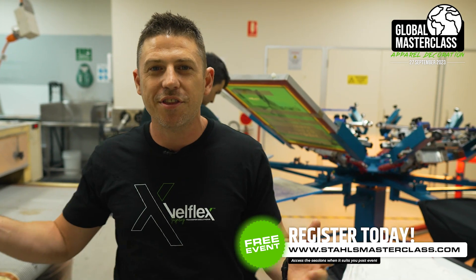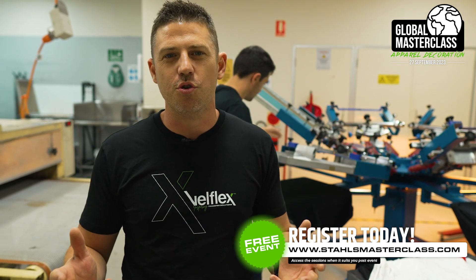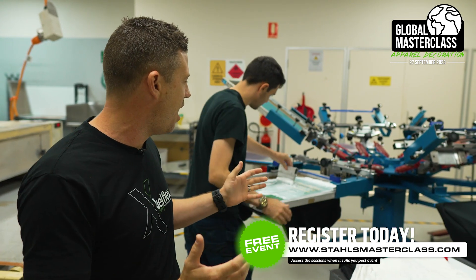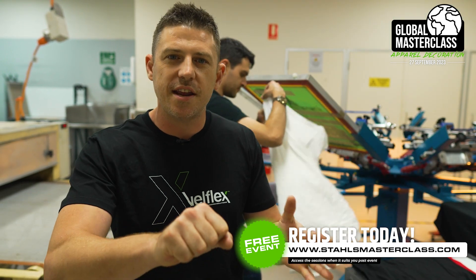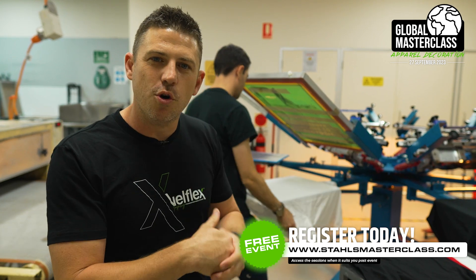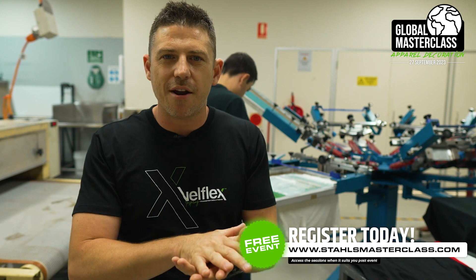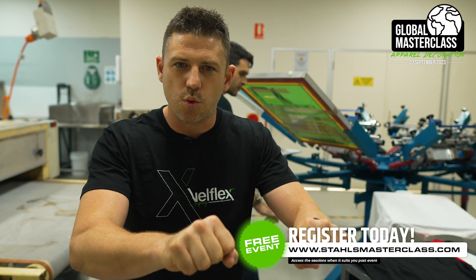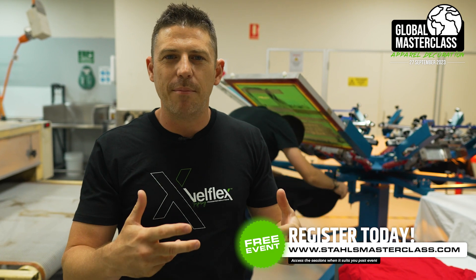First off, screen printing — we're in the screen print room right here. What is screen printing? It's one of those real traditional garment T-shirt printing processes. Been done for decades. It's done using an ink, typically a plastisol ink, and it's printing and squeezing that ink through a mesh down onto the garment that you're printing. So it's using a big screen that's a mesh and it's had a stencil made on it. You're literally squeezing the ink through onto the T-shirt or onto the garment. You might do a couple of passes.